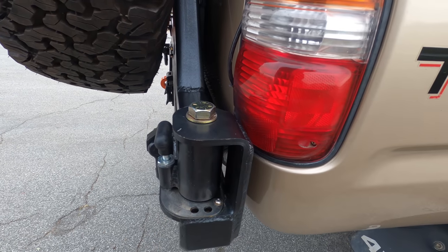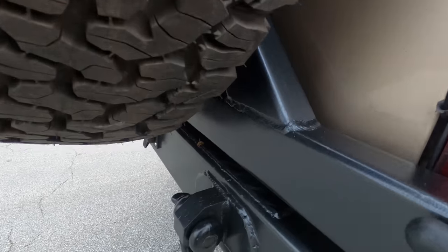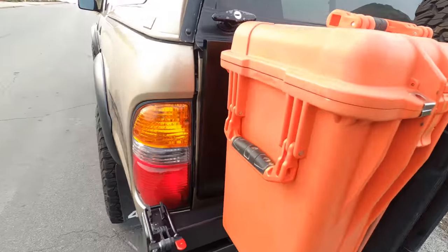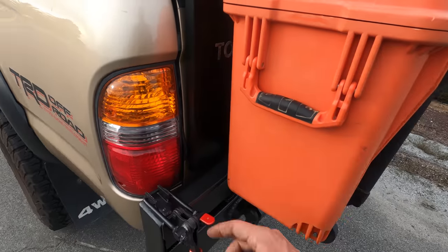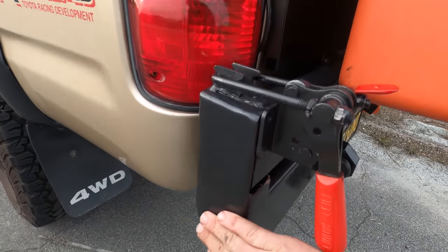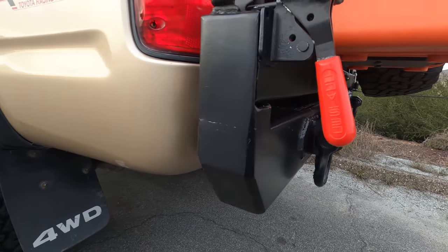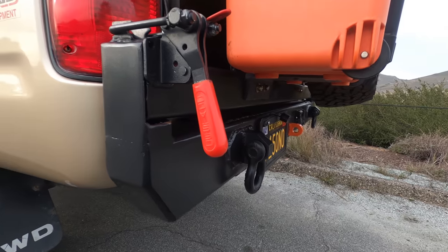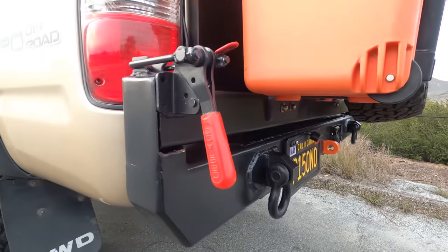I was super low on my wire speed, so this made a huge difference. The welds are so much cleaner, and I've had to do so much less grinding, almost no grinding for the swing out, made the work a lot less. So much, much nicer fit and finish on the ends, smoother. Just getting down my system, getting down the design, knowing what I'm gonna do ahead of time, lets me do a better job because I'm making less mistakes. So let me show you how this works.